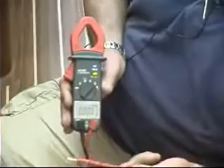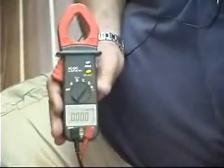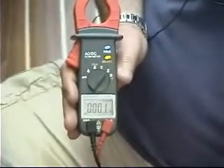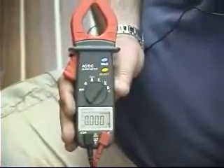It's going to give us the sensitivity I want, because in this case I'm going to be looking for maybe fractions of a volt of leakage into the bilge water. This can have very profound corrosion effects once it occurs, and it can be very hard to find.